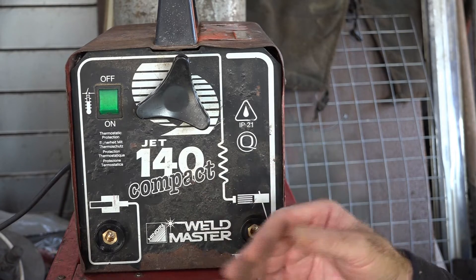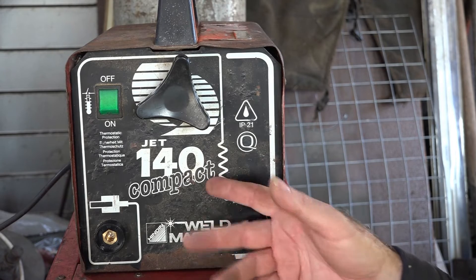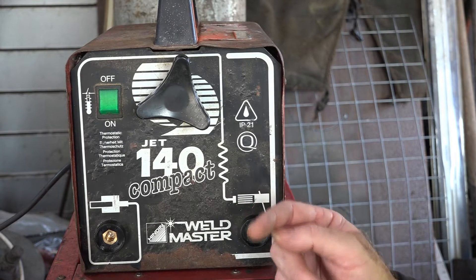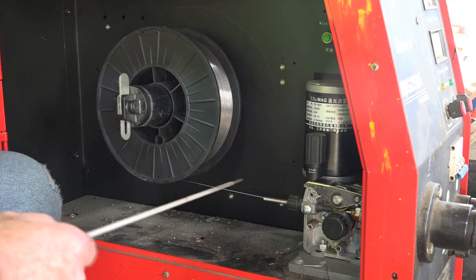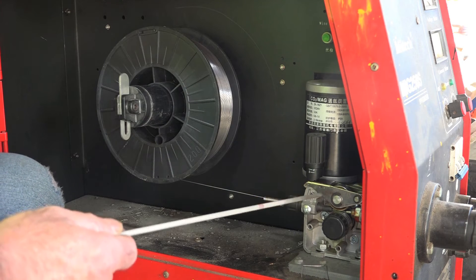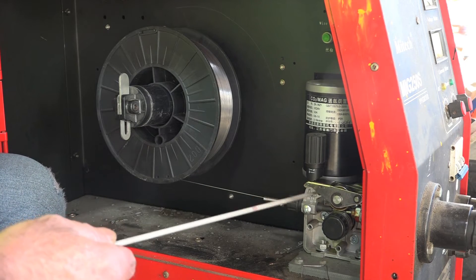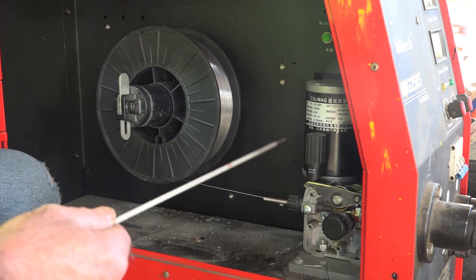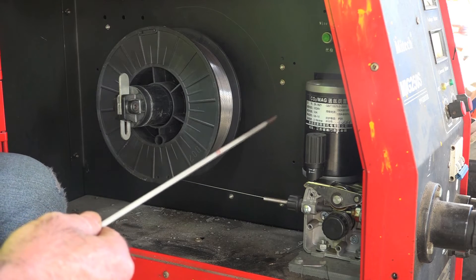You can buy these old stick welders second hand for 20 or 30 dollars if you just want to get into welding - you don't have to spend a hell of a lot of money. With the gasless MIG, you're going to have to learn how to set up your roller wire, set up the tension in your drive rollers, and that can be a little bit tricky when you're new to it. It seems quite overwhelming to start off with, but once you get the hang of it, it's as easy as falling off a log.